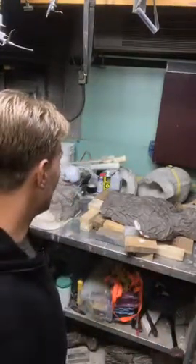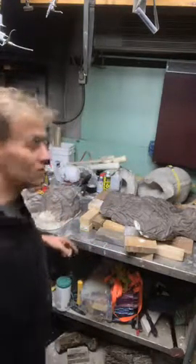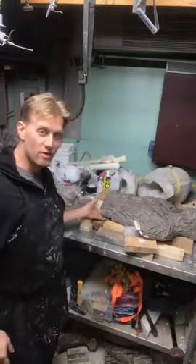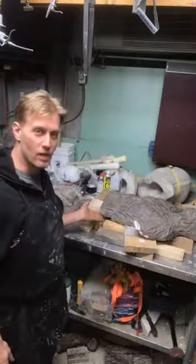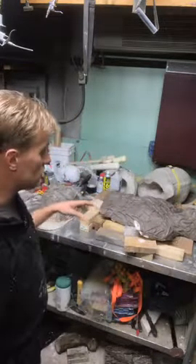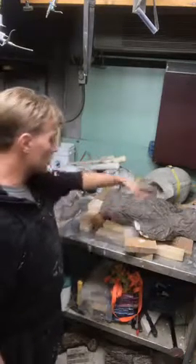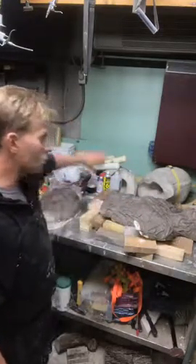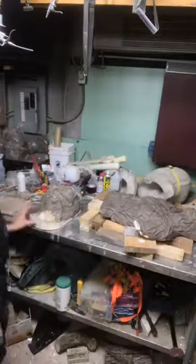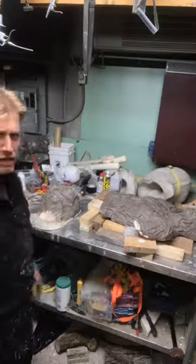What I did on this mold to get it prepped — I think you guys can see this on the video, I may have to move it a few times. We have a plaster life cast that we made of a guy, so I have just kind of a front half of a chest that we clay-sculpted on top of. To get the mold wall, I've got to build up a bit so I can do my Ultra Cal in order to pull the latex out of it. This guy doesn't need a whole lot of mold wall.